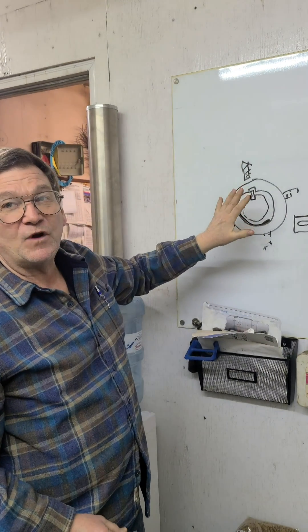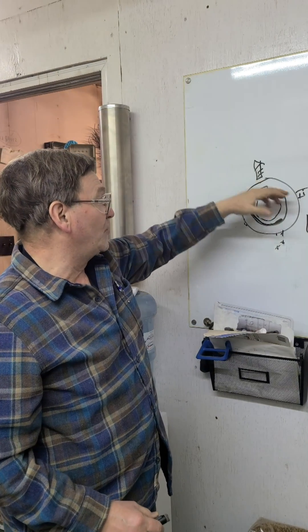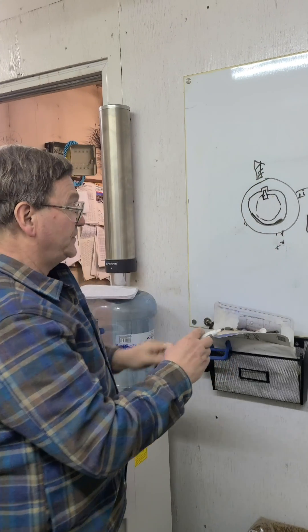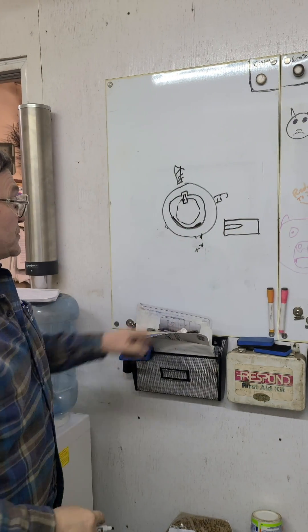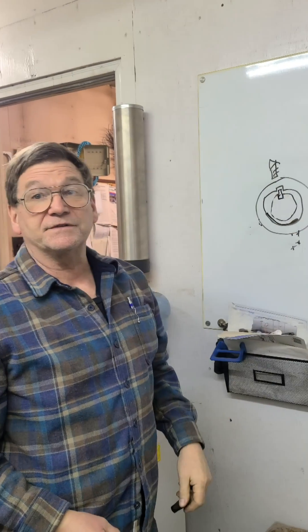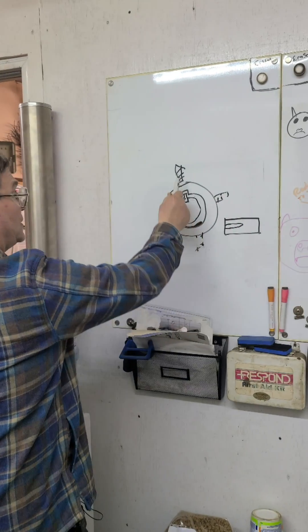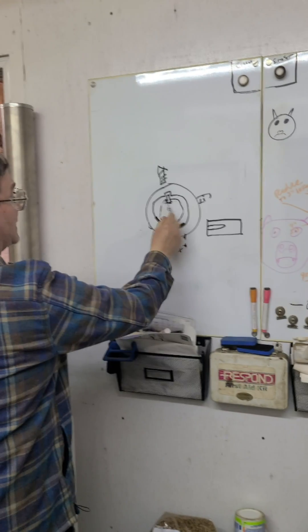It's not a terrible way, and it's how it's done in industry 90% of the time — you'll have one already in the hub whether they have a second one over the key or not. Most generic equipment not built for a specific manufacturer will be keyed out to the end and preset with a set screw to hold the key in. Another option: if you don't have a key over it, you can zap a little bit of weld on the key so it doesn't fall out — another way to handle it without needing a screw over it.